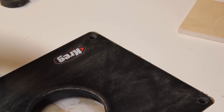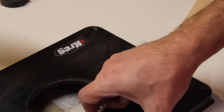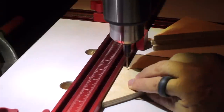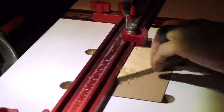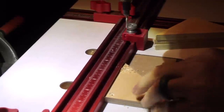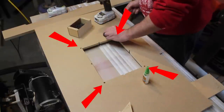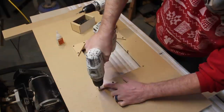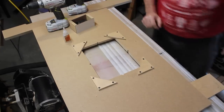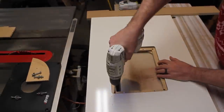The center piece comes out and there's that ledge — fits in there pretty good. I added some screws so you can dial in the height of the router plate and get it perfect with the table surface. These pieces of plywood will give additional strength to the router plate, ensuring it stays exactly where it's supposed to. Each corner of the router plate is attached to the table surface with screws, and the screw holes were a little too close to the edge — I wanted more material for the bolt to grab onto. The glue was probably not necessary but I used it anyway, and then I drill out the holes. This is now ready for the router plate to be installed.